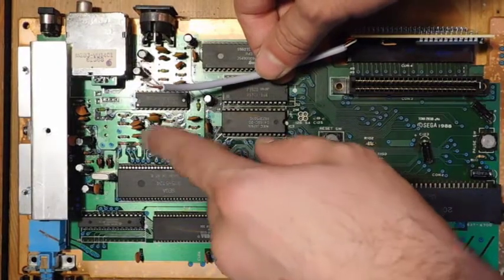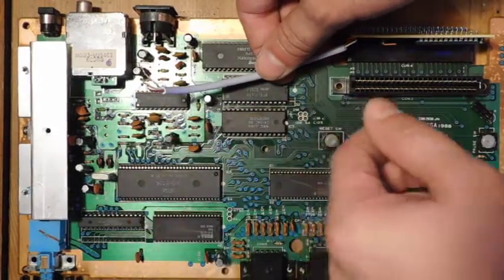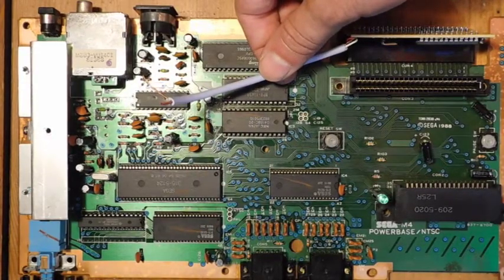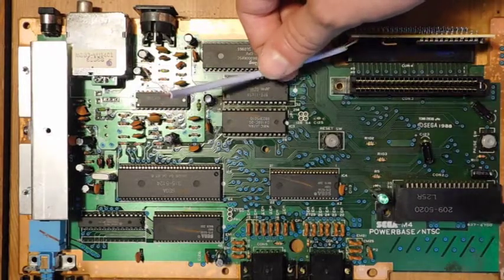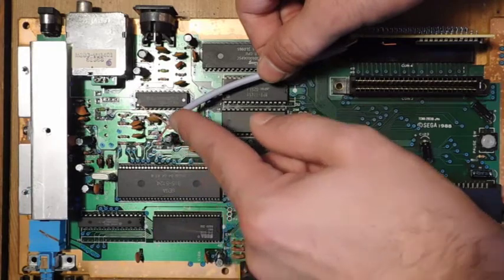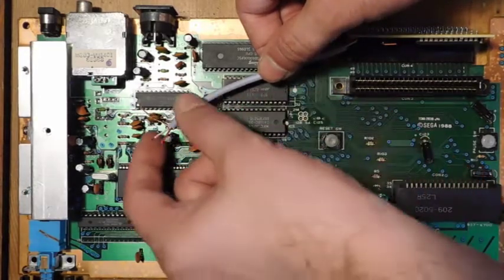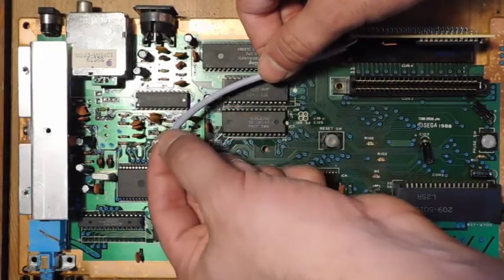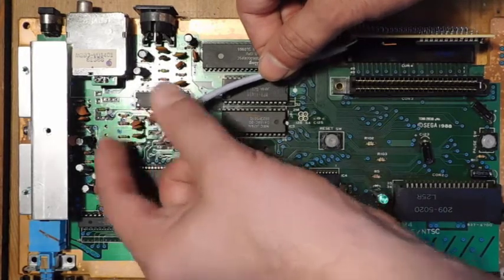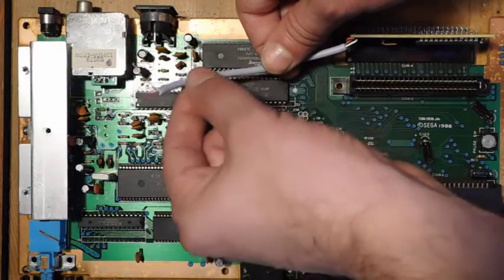This is an American Master System. If you have different models, the positioning of this might vary. All of that information is listed on the Tim Worthington website, and I'm going to provide a link for that in the description. So you'll notice what I did was I cut the wire, and then I stripped this outer shielding, and then it exposes three things. It exposes the two wires that are inside, and then this is the ground, this is the shield on the outer core of the wire.